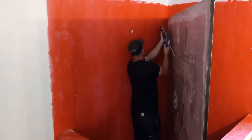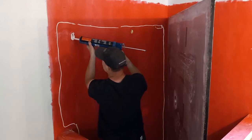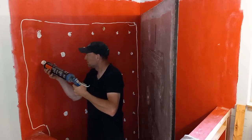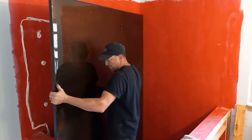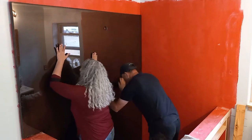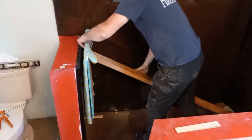All that's left is to glue the panels into place and caulk all the joints to seal it up. This was a learning experience. If you're duplicating this shower build, don't use single-part glue, caulking, or silicone to attach the shower panels to the wall — it will take forever to cure and hold. Use a two-part glue that won't hurt the high density foam. After this panel, I started using an anchoring epoxy typically used for anchoring bolts in concrete.